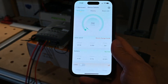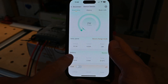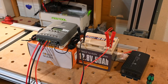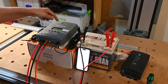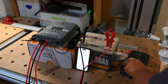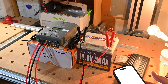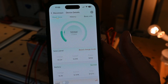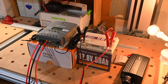The solar panel has done its job — it has charged up my little 50 amp hour battery and I'm only putting in about two watts with the battery sitting at 14.4 volts. Now I want to run a load off this battery and monitor how quickly the charge controller will start charging it back up. I've got one of my 500-watt inverters with a little light array hooked up, and immediately the charge controller is putting in around 189 to 200 watts back into the battery with this load running.